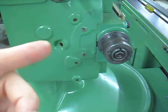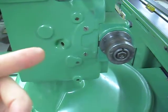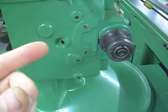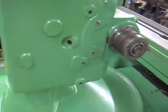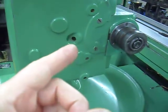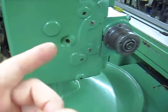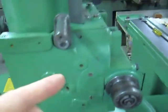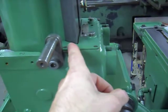Sure enough, this one in the middle — he didn't realize he had one because there was a broken-off bolt with a hex head, broke off flush. He drilled it out, and it was all painted over with rust and grease — he didn't even know it was there. So now he's able to lock his gib. The gib is right under here on this side, under the felt way cover.